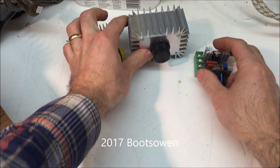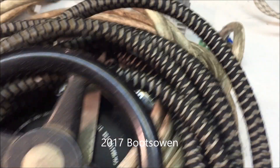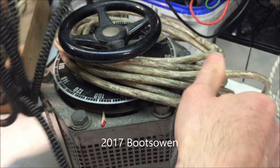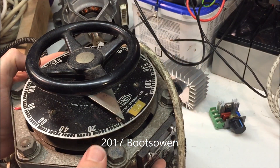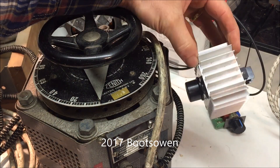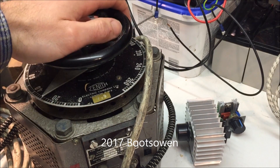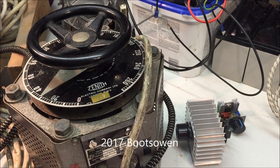Just to wrap all this up — what I would prefer to use in most situations, if you have the option, is one of these: a Variac. This is a Variac that can do about 8 amps, so in reality this can't handle what this little thing here can. If you really want to make it happen, go and get one of these big ones. But even this is kind of on its limits if you're putting it through a washing machine motor on full belt. So there you go — thanks for watching.